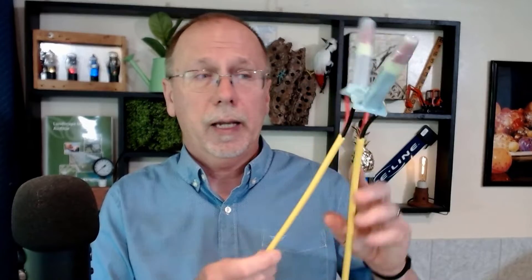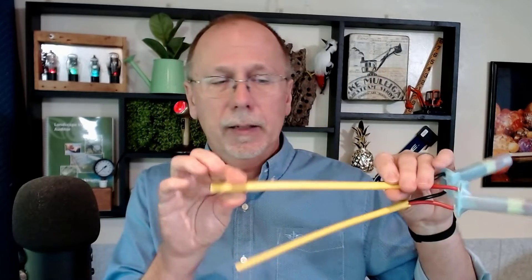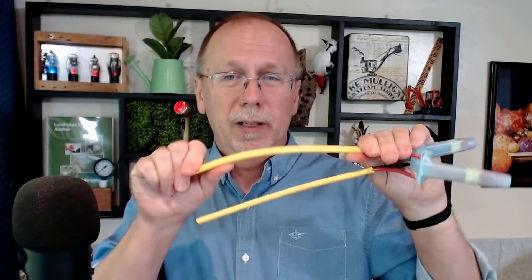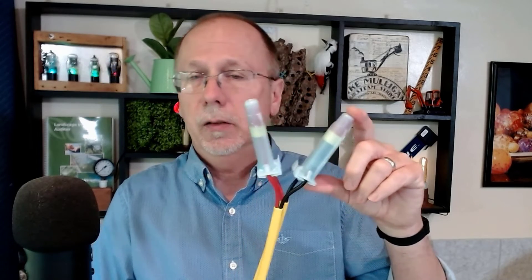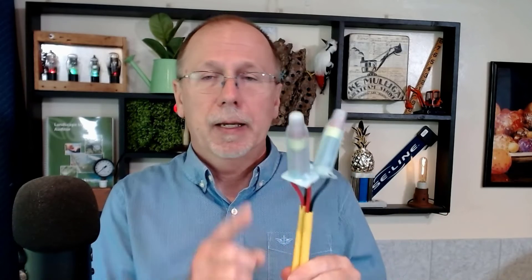Two-wire is completely different. The cable itself looks different — it's a double-jacketed wire with just two conductors, hence the name. It has an outer jacket made of high-density polyethylene, or HDPE — the same material milk jugs are made of. It's tough, hard to bend, impervious to water, and much more durable than conventional wire. The splices used are DBRy-6 splices — waterproof splices more robust than the standard DBRy splices used on conventional wire. The key difference is the gel inside: DBRy-6 splices are rated to 600 volts, while standard DBRy splices are only rated to 24 volts.